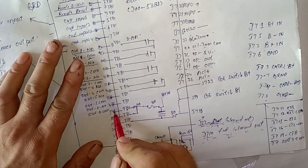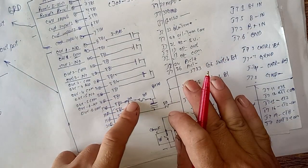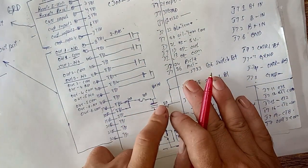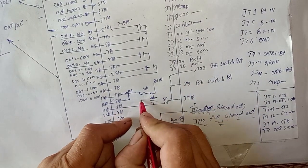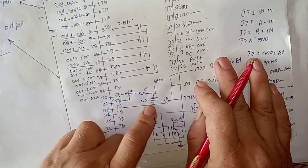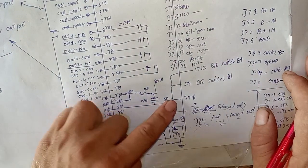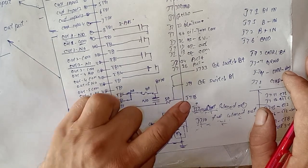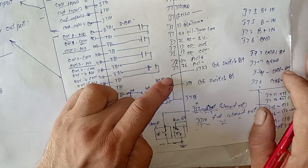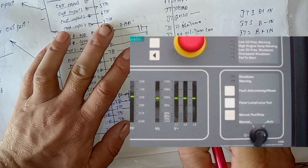From pin 17 to pin 22: TB1 pin 17 and TB1 pin 18 are jumped together and then made into one wire going out through a fuse as a tandem pair. From that fuse there is another NO contact, and from TB1 pin 19 the wire goes to that contact, then through a 5-ampere fuse. The wiring route then goes to J7 connector pin 18, J7 pin 9, and J7 pin 23, which is generator switch positive.